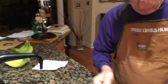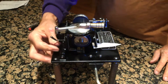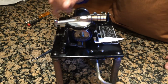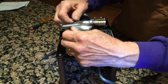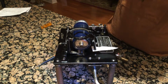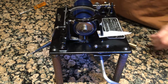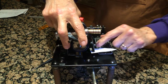You need a piece of paper, it's about 3/1000ths of an inch thick. And you're going to set that there, and you're going to engage the half nut. Okay? So doing this, you have to do it with the reproducer on. So doing this, you can just leave the two thumb screws out. You come in, you come down, you hit this screw, and you screw it in or out so it engages. Then you test it again with a reproducer in with the paper.